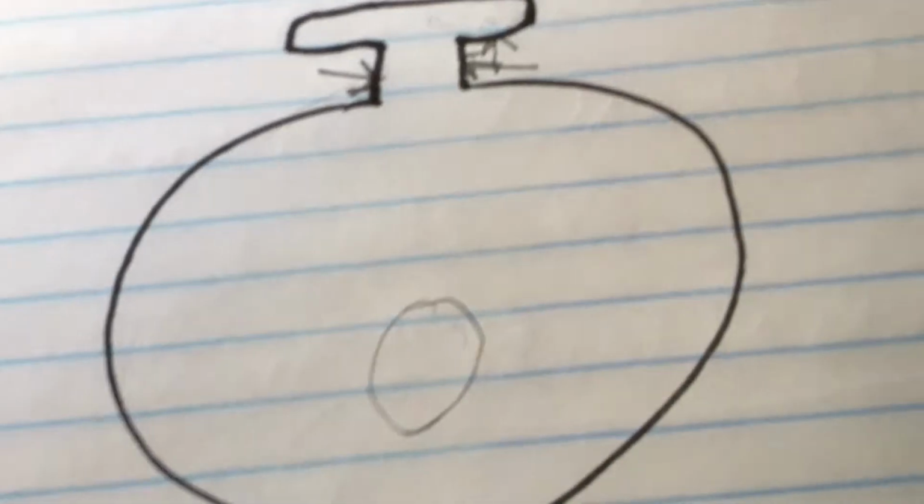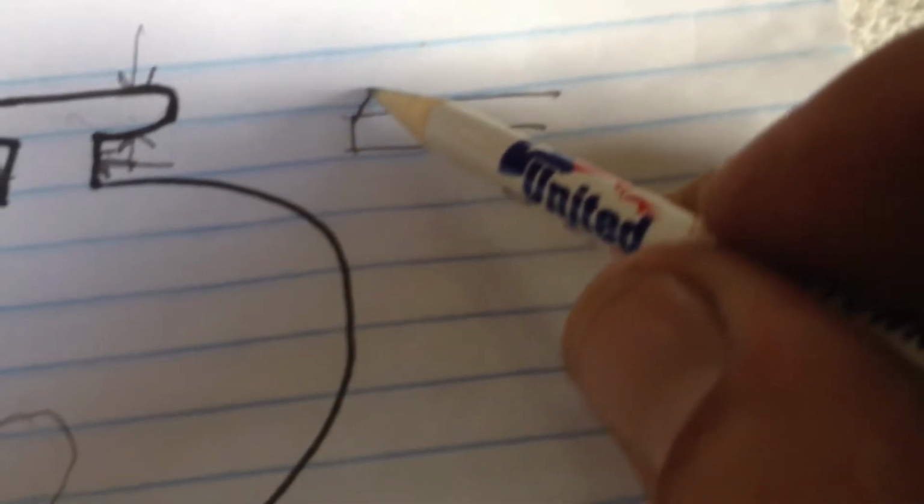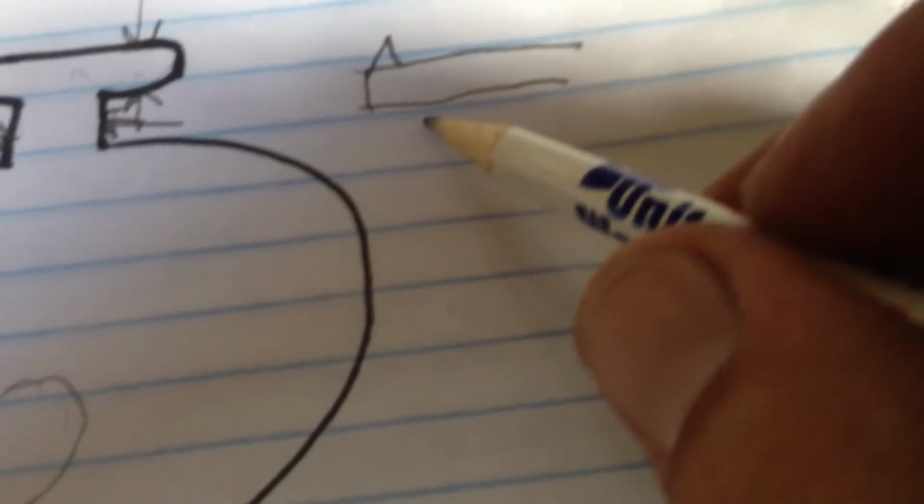As you start working, you're going to be able to feel it out. My advice would be to start from the side closest to where we are. So let's say this is the barrel, this is the sight, this is the bayonet lug here. It would be orientated like that. You would want to start on this side, because you want to start where the bayonet is actually beginning to slide in. You want to start feeling what kind of effect you're having. You don't want to start on this end, because the bayonet's still just going to get stuck right here, and you're not going to know what's going on back there. You want to fit it a little at a time.